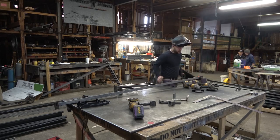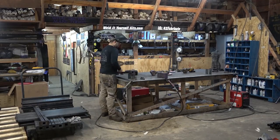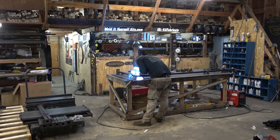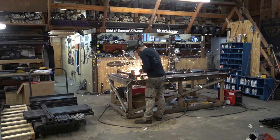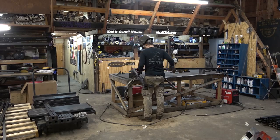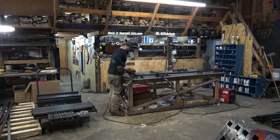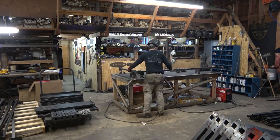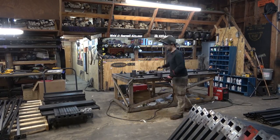The jig probably takes 20-30 minutes to build and get right, get all the pieces tacked down nice and square. But this run you're seeing here took 1 minute 58 seconds start to finish to make one of these assemblies, and we have to make 60 of them. Getting that cycle time down is not only good for production but also for your sanity so you're not doing the same thing for 4 or 5 days in a row. With the jig elevated up in the air a couple inches, we can make both the left and right-sided pieces because we can flip the runner over and the flanges don't hit the table. Worked beautifully.